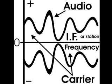However, if we were working in an AM radio and determined that the problem is in the RF section, we would switch the signal tracer from the AF connection to the RF connection, and we would be looking at the modulated signal through the radio. Depending on where we are in the radio, it will either be the IF or the station frequency.